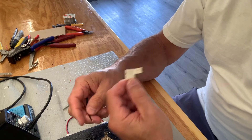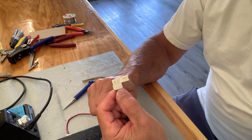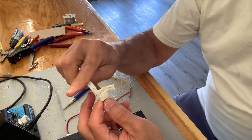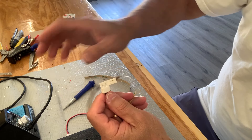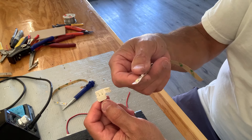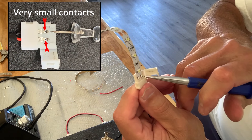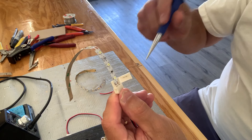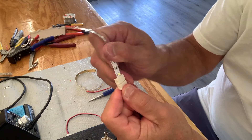Before we get started, you might be asking: why would I want to solder a wire on the end of an LED strip when snap-on connectors are available? Well, to start out with, there are different kinds of LED strips. There are some real cheap ones that are about eight to ten bucks, and when you go to try sliding them under the little fingers, it's very difficult — they pull out easily or tear apart. Then they make a mid-grade strip that has more copper and can be pushed under it. On these little fingers there's just a small contact point holding the strip, and it doesn't give you the full power of the contact. When these are closed and snap shut they just don't hold very well and they pull out.